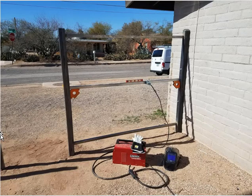So in my case, what I'm doing is I'm cutting the 1.5 by 1.5 inch 14 gauge tubing to fit inside my posts. Now this is more work for sure, and you gotta be doing measuring and cutting and whatnot. You can see how the guys that were running proud along the outside, and they're just butt welding those 1x1 stock and just whipping around. They're going to be done a lot quicker. But we thought this looked a lot nicer.